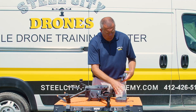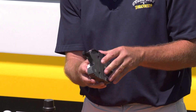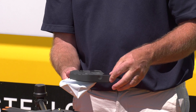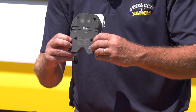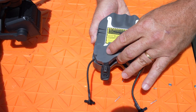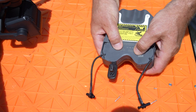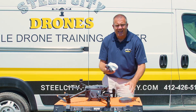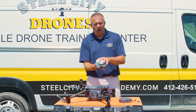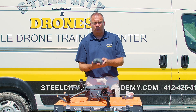This is another parachute module, and it's very easy to swap out. This is the original one right here — all you have to do is take these four set screws off and attach the new module, and you'd be ready for another test. The company makes kits where you can buy just one parachute or get a replacement module as well — they sell it both ways.